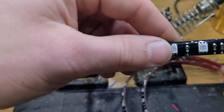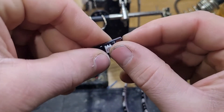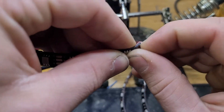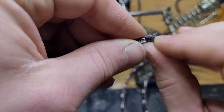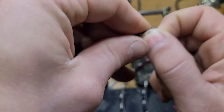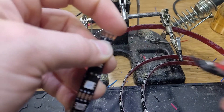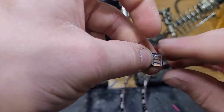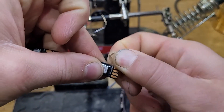Go ahead and grab your LEDs and you'll notice that there is quite a thick polyurethane coating over top to protect those LEDs. What we have to do is actually peel back the very end of that — if you can get your nail underneath it and kind of peel it back to reveal those copper solder pads underneath — and then we're just going to go ahead and clip off that coating there.